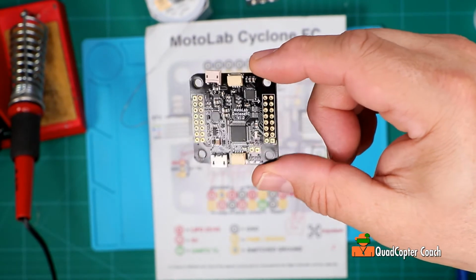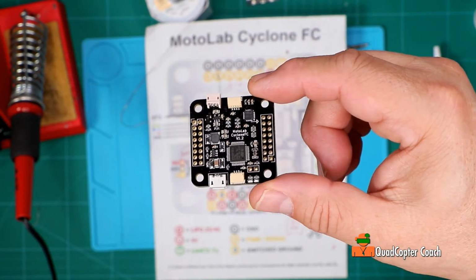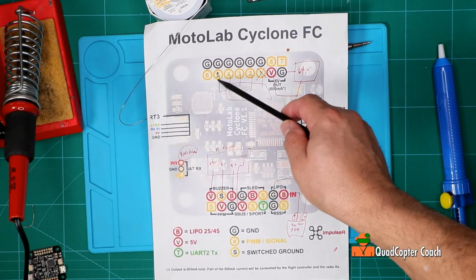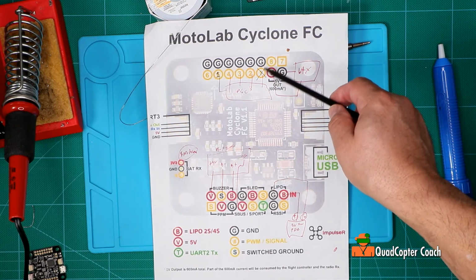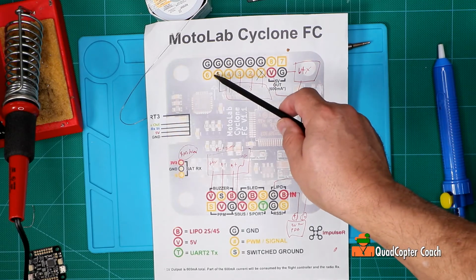I was going to do a really involved build video, but instead, here's 100 seconds of the best parts of using all these parts that were no good in this build. Stay tuned. I'm ready to tin up the flight controller, but before I do, I need to know what I'm going to tin because this is really not well marked out. I'm going to be connecting to motors 2, 3, 4, and 5, not motor 1, because if you remember, I mapped that out since it doesn't have DMA, and I want to run D-Shot, so motor 1 has to go over there.